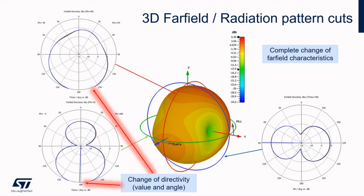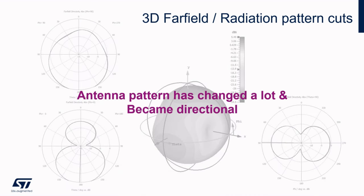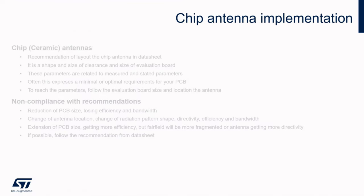Additionally, the complication is that while the antenna works well in the presence of the human body, it will hardly have a good match when the human body is not present. This must be kept in mind, and the performance of the antenna should be checked while the human body is distant from the device and operation is requested at that time. Antenna pattern has changed a lot and became directional. Affected efficiency is the cause of less range. It is advisable to correctly position the device and orient the antenna in relation to the partner device with which it communicates. We can see a decrease in gain in the direction of human tissue, and the implementation of a PCB antenna is not easy if we want to maintain its performance.